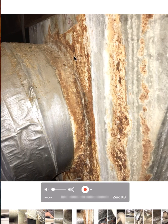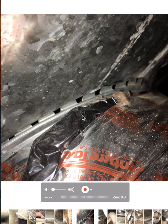This is pretty indicative that they've had a swamp cooler when you start seeing this kind of rust — and duct tape to hold on your ductwork. That's terrible. This stuff gets brittle in the attic. This is a mess. Look at all that leakage. Sometimes guys, this is right in your face and you can't miss it.